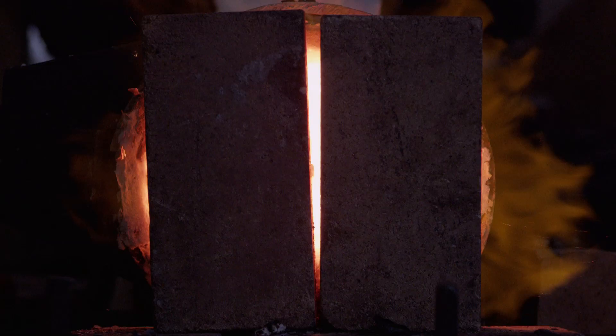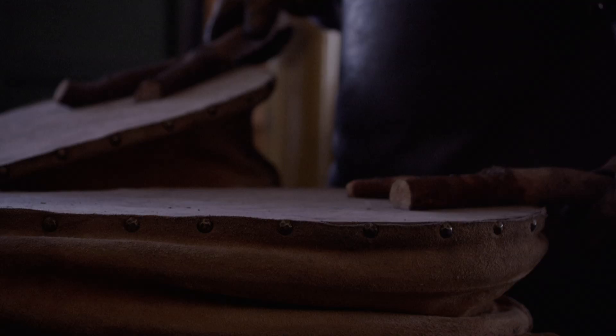Then you make a large mud brick stack called a furnace, and you would load charcoal in that, get air through the bellows, and dump in the iron ore, then another layer of charcoal and more iron ore and more charcoal. And over the course of a day, you would pull the impurities out of the iron ore.